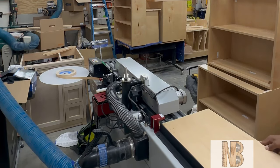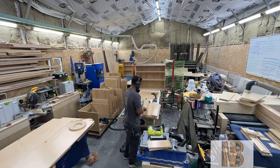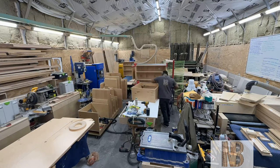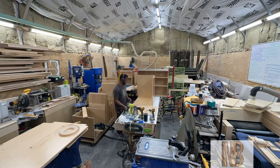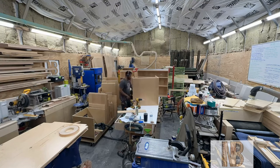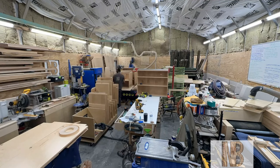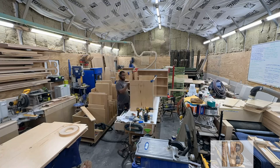Once all my pieces are edge banded — you can already see some cabinets are built in the background — this is the assembly process, which I actually enjoyed because Mosaic makes it so easy. All of these cabinets are built and cut with blind dados, which allows me to go through and build parts that have their own slots and placements. There's no guessing or shimming; it's mostly just putting pieces in, lining them up, applying glue, stapling, and then putting screws in and moving from one cabinet to another.